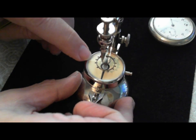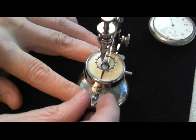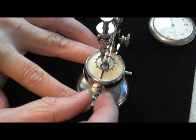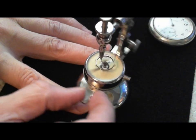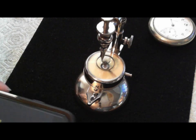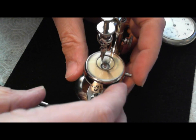I just use my finger on the edge just ever so slightly. You have to make sure that the pivot on the bottom of this balance is just touching the glass that it's resting on. This is a thick piece of glass. Now when I move this from side to side you'll see that the balance moves with the master. I've moved it and I put my iPhone on slow motion.